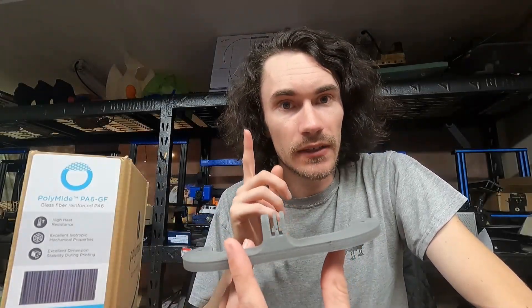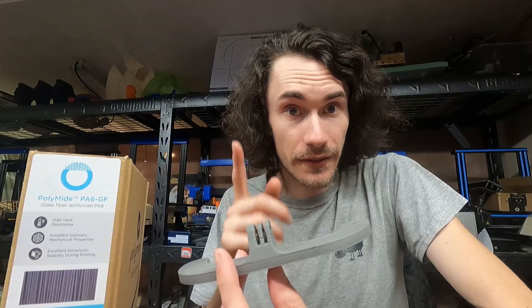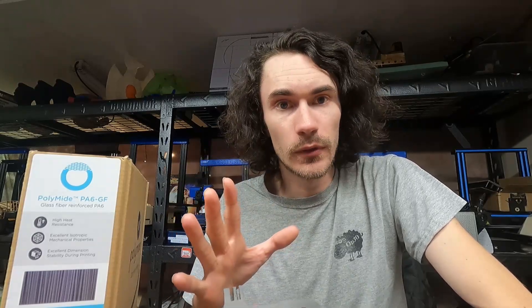The reason I used copper nozzles is strictly because they were cheaper. Normally I'm a fan of micro Swiss plated brass nozzles, but I was able to get the copper ones for about $5 less per nozzle on Amazon, and a little bit quicker too. I viewed the nozzles as a completely consumable item — when I'm done printing all the parts, I'm going to yeet that nozzle into the bin, never to be used again, because I legitimately expect it to be blown out. When it comes to printing an abrasive material like this, I'd rather just get a couple of cheaper nozzles, switch them out as needed, and toss them, rather than buy one super expensive ruby diamond unicorn fairy dust nozzle. Not worth it to me.